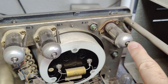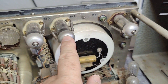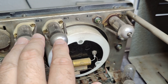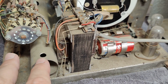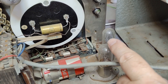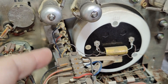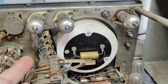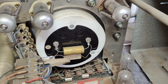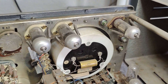This one is the 150 volt voltage regulator tube for the anode voltages. The filament systems are of course in series. The 300 milliamp constant current bulb goes in series with the two tubes here, and the voltage sensor probe I talked about earlier got its own voltage or current regulator tube. Then we can see the really cool bulbs for the scale — those will light up different scales on the meter depending on what button you select, so the right scale lights up. That is such a nice feature; you don't see this in many meters. It just makes readout easier.